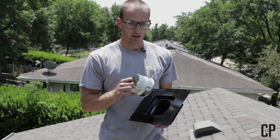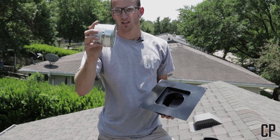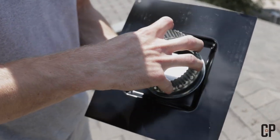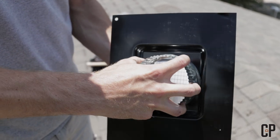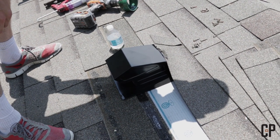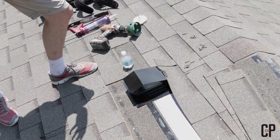This piece right here is the collar — when I put this down on the hole, it sticks into the hole and screws in slightly so it won't pop out. This is what the insulated, adjustable piping will attach to inside the attic. It's got a little gap here to get the twist started — she'll pop right in, be loose but won't pop back, and lays flat. We'll figure out where to station it, nail her down, cut the shingle underneath, caulk all the nail holes, and start putting the old shingles in and cutting them to fit.